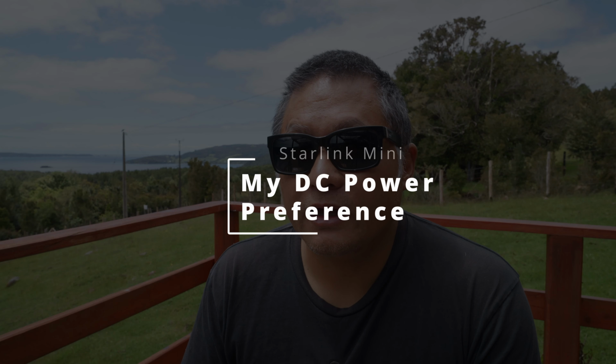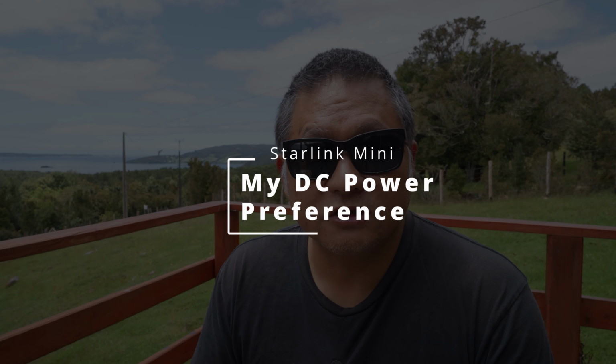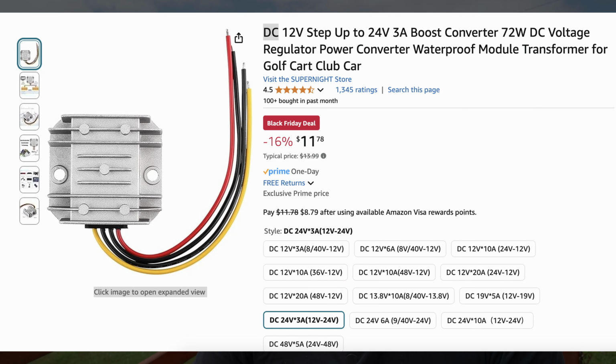Personally, I've been using just a simple 12 volt to 24 volt boost converter in the vehicle. So in the van, we have power going into a boost converter, and the boost converter comes out with 24 volts, supplying up to 72 watts, which is plenty of power. And that's just been wired directly to my Starlink cable that's been running our Starlink Mini dish, flat mounted on the roof with no problems at all.